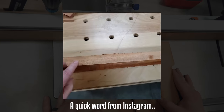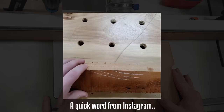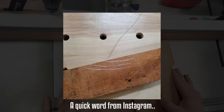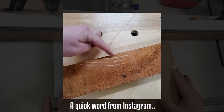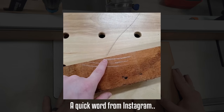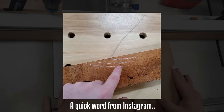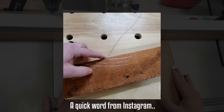Someone asked about uphill versus downhill direction. On the top face, for the best results you go to the adjacent face and figure out where the grain is coming out. If the grain is going in this direction, hold the board so the grain is horizontal — now you can tell that right to left is the downhill direction, and left to right is uphill where you'll get all your tear out. No tear out going downhill, lots going uphill. The reason is that going downhill, the end grain isn't supported so it cuts and slices off cleanly with hardly any resistance. Going uphill, the end grain goes into the wood with resistance behind it, which causes it to pull and tear out rather than cut cleanly.